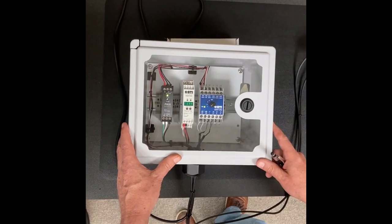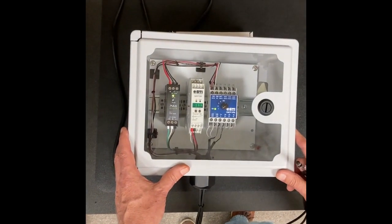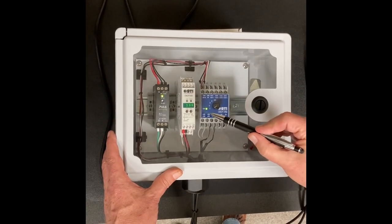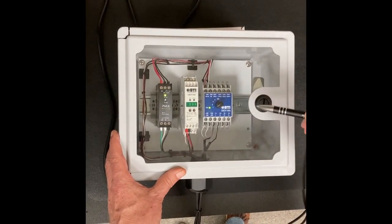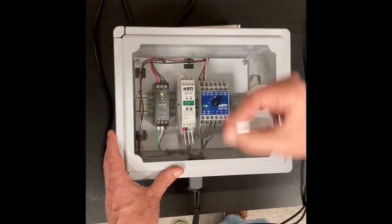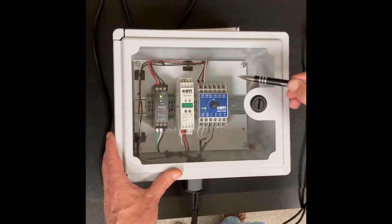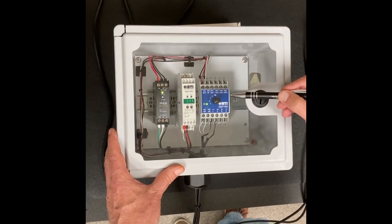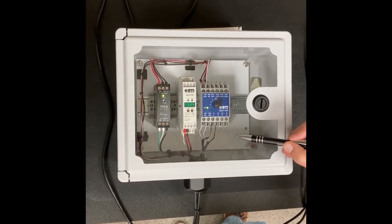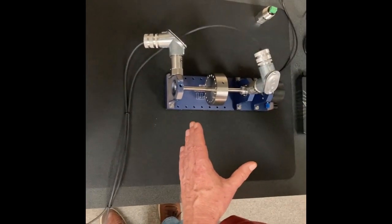And here we are in the laboratory, and you can see the complete HR4VT system, which consists of a power supply, the CMCP-730D display and relay model, and the HR4 high read model. The line power comes in, 24 volts going into the CMCP-730D and into the CMCP-HR4, and then connected to the input of the high read model are the transmitters, which you can see over here.